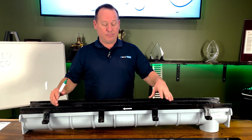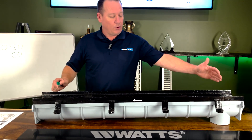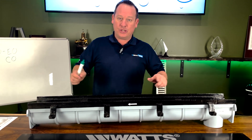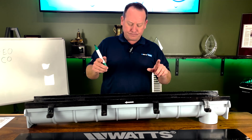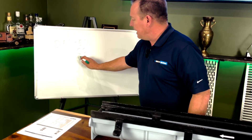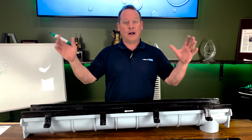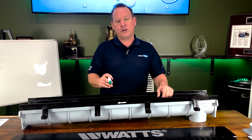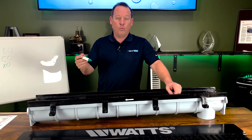For more complex projects — say you need your outlet at 40 feet on a 50-foot run, or you're running the drain in a complete square using 90s and T's — we use XO for a custom outlet. That tells us right away there's a custom outlet situation. All we ask is a quick pencil drawing showing where you want those outlets, and we'll make it work for you.